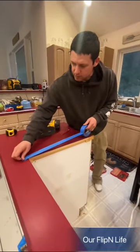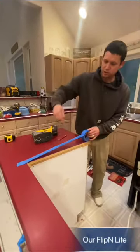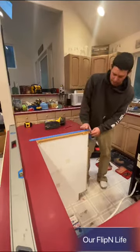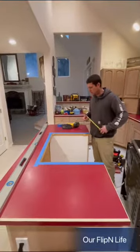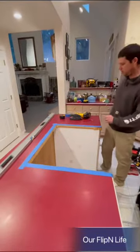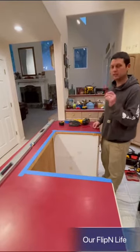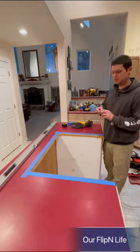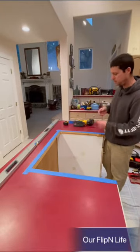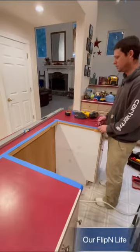What you want to do is put your tape down where you're going to cut. I usually like putting it on both sides, but this one we're not going to be able to put it on both sides very far because the whole edge isn't going to get cut off. Now it's all taped off all the way around. Make sure and use a blade that's meant for laminate — I bought a jigsaw blade. The trick is the blade needs to be cutting on the down swipe instead of on the up. Typical jigsaw blades cut when they pull up; these cut on the down stroke, which keeps the laminate from chipping.